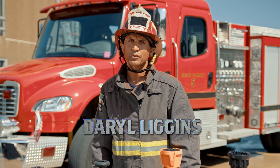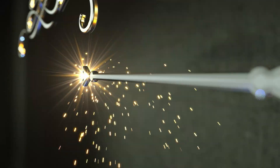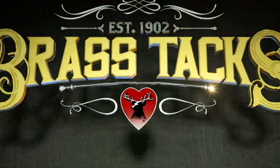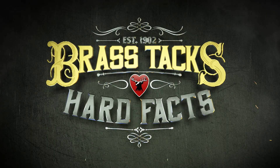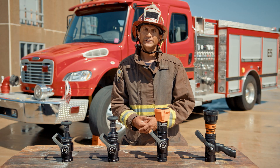I'm Darrell Liggins and we're getting down to the brass tacks and hard facts of the danger of inlet screens. One of the basic things we need to accomplish on the interior of a building to have a successful fire attack is to create a proper fire stream. One of the things that can harm us is if we have any type of clog in that nozzle that reduces the amount of GPM getting to that nozzle.